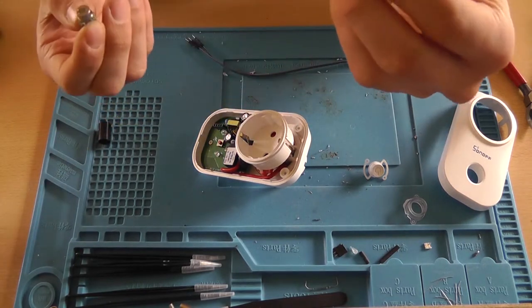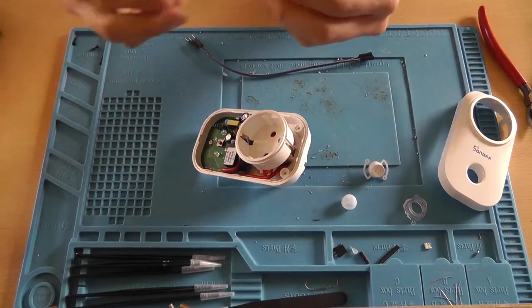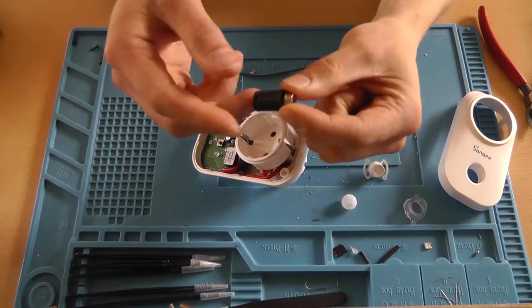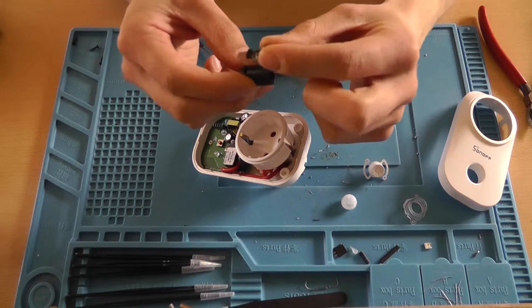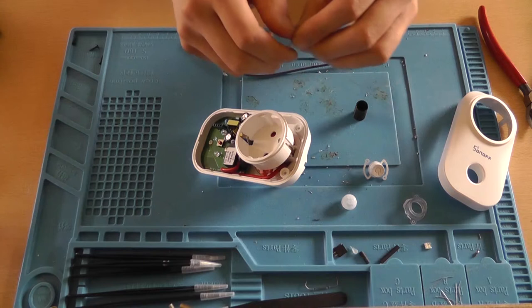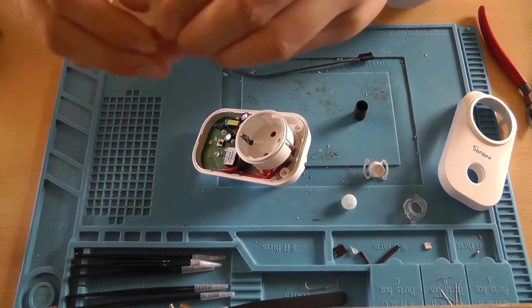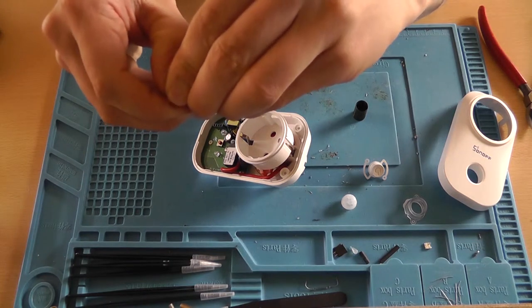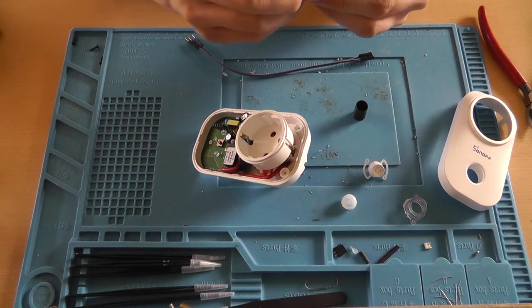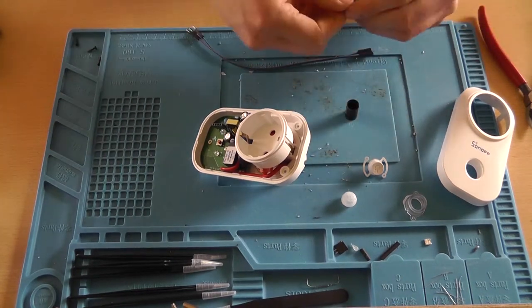Remove the lens cover and the other thing that goes around the PIR sensor, and now if you insert it into the 3D printed part, you'll see that it's not long enough to fit. Now this is alright, because we'll be fixing that. What we need to do is remove this plastic header spacer, pin spacer, like that.